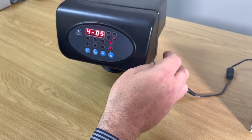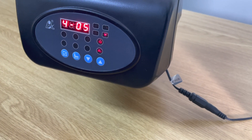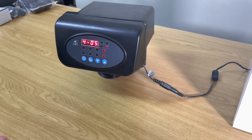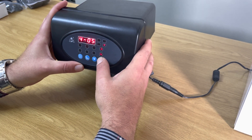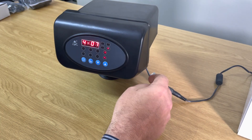This is your brine refill — the amount of time the head takes to push water back into the brine tank. Five minutes is generally long enough, but if you want to make a change, let's take it to 7 minutes. Press the square button, press the up arrow key until it gets to 7, press the square button, and it's locked.